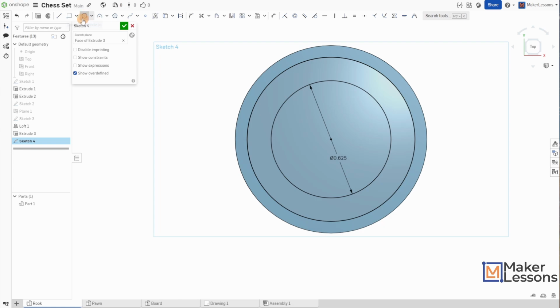And now I'm going to give myself a construction line straight up, just so I can measure things off of it. That's not actually going to be part of my sketch. And then I'll draw two lines coming up here. They don't have to be perfect right now, because we'll add dimensions to start defining it. So first one will be a dimension between this line and this line. And I'll set that to 30. This line and this line. I'll also have that one 30.